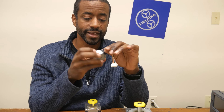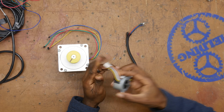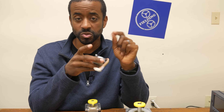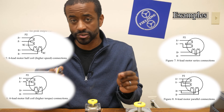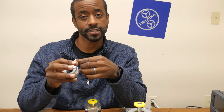These smaller motors will often have five or even six wires, as you can see here. You can usually drive these with the same bigger drives, but the way you wire is going to be a little bit different. Depending upon which wire you connect to what terminal, you're going to get different performance characteristics. Some will give you lower speeds and more torque, and vice versa. But because of the variability and options, we'll just cover the four-wire setup today.